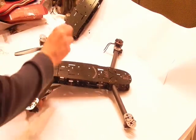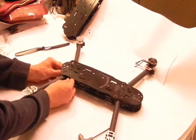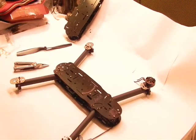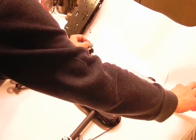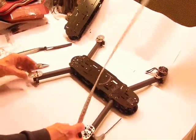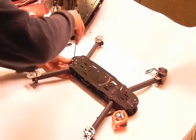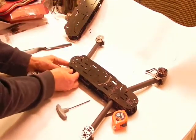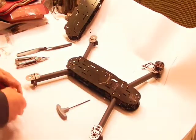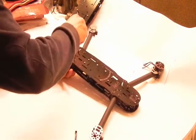Punching over is a bit of a strain. So now we can still move our arm a little bit, just in micro amounts if we want. Now we're going to measure our distances. Ruler or centimeter or whatever device you want to use. Right there I have 37 centimeters. So we'll double check this side, roughly setting it at 37 centimeters. Move this arm back a little bit. There we go. And you can use the black plastic as your grip for moving the arms. And that's 37.5, so a little bit closer, maybe loosen this up a bit.